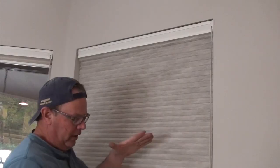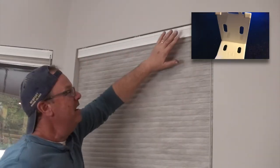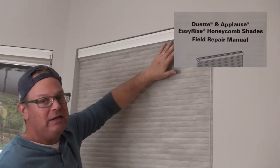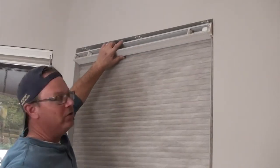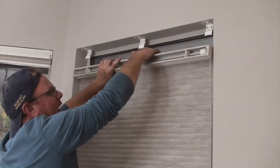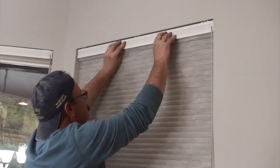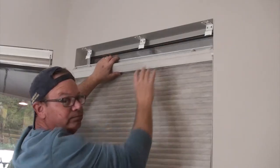Let me first show you how we take this thing off. Now it is fully extended. I can scrunch it up and then grab it off, but I'm going to take it off the top and slowly lower it to make sure that I compress the honeycomb. The things they don't tell you when you watch all of these videos on how to fix these is how do you take them off. This is three brackets - this is called a duet or an applause honeycomb blind, so the brackets may be different but they're pretty straightforward. Bang it and then you curl it - it's important that you curl it because there are pieces on the bottom that the top piece holds on to. Just bang it off the top ones, curl it, and you can lift it off the bottom ones.